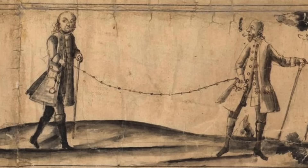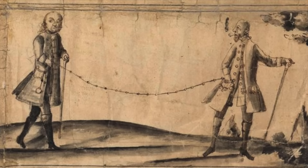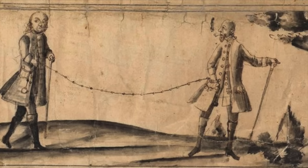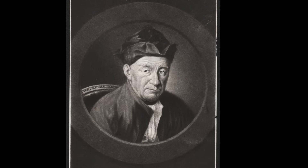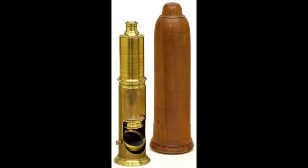This was a lot faster than previous methods where you had to use a rope, tape, or surveyor's chain to physically measure out distances — hence why techniques like this are typically known as tacheometry, from the Greek for quick measurement. But while Watt's system was faster than earlier techniques, it still required two people to carry out. A couple of years later in 1778, a German instrument maker named Georg Brander came up with a better system that could be operated by a single person: the coincidence rangefinder.